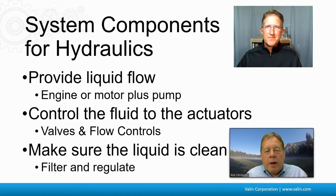With electro-hydraulics, one of the driving design features is that they're compact and they try to eliminate components. What you'll see go away in the electro-hydraulic packages are all the big hoses, the big HPUs — the hydraulic power units. A lot of the supporting equipment, valving, accumulators, and regulators — all those pieces are going to go away and be built into the actuator itself.